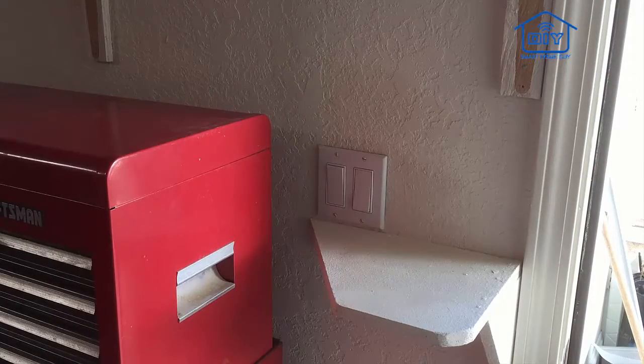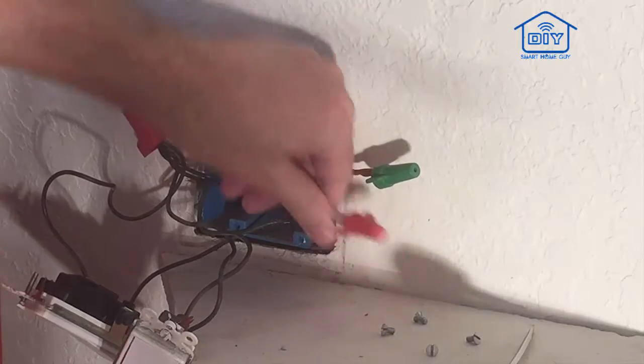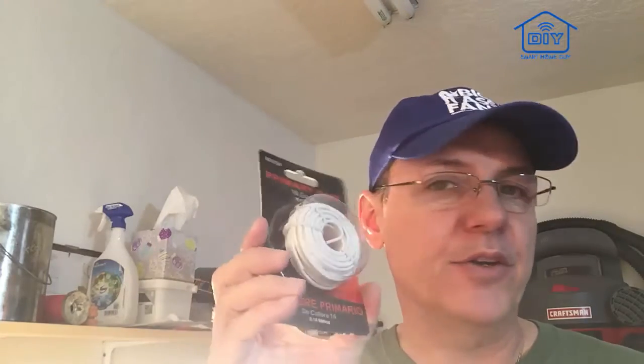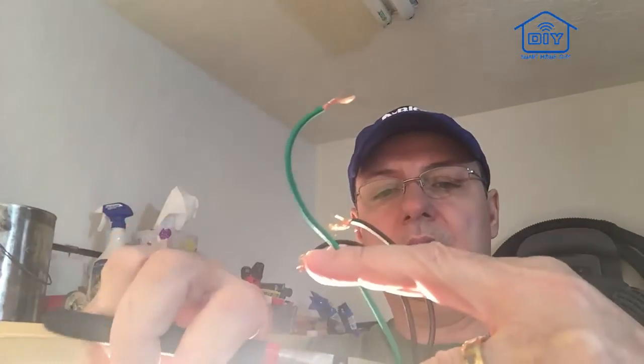Let's go ahead and take that wall plate off. So what we have is the green cap with the bare wires — this is our ground. The white, that's our neutral. And the black will be our line and our load. Sometimes when you're doing these switches you may not have all the wiring that you need. One option is you can go buy a roll of wire at your home improvement center. The other thing I'm going to do this time, because I have this old dimmer hanging around that I pulled out of my bar area, I'm going to salvage the green wire from this — just cut it and strip it so I've got bare lead on both sides.